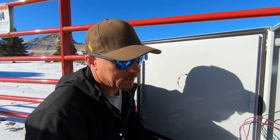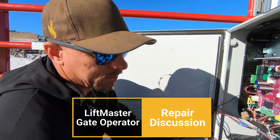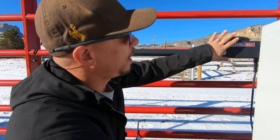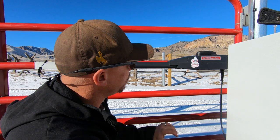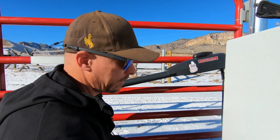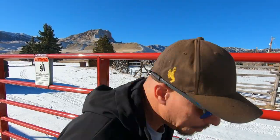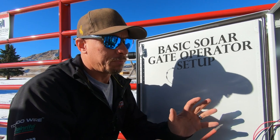This is one of those cases where things happen. We're going to continue to use LiftMaster for these arms — I think there are some better brands, but we've got some of these installed elsewhere. I'll take this apart and show you what happened inside this arm. A nut came off and basically locked up the arm, so we can't pull this rod in and out even when we disconnect it. The gate won't move — it's got broken parts — so we're going to replace it.